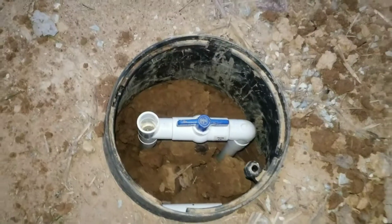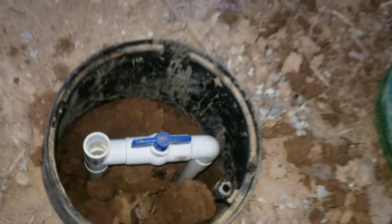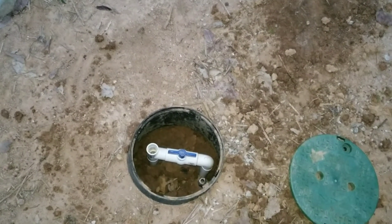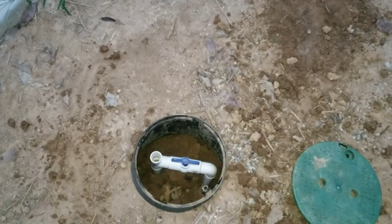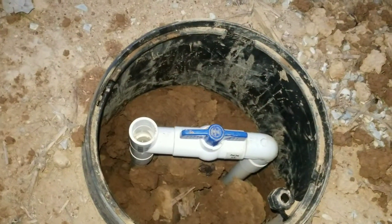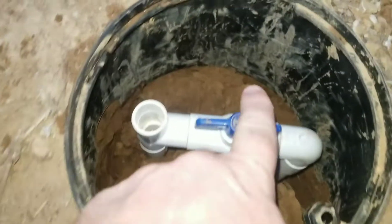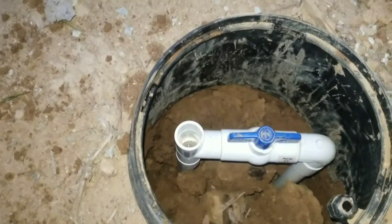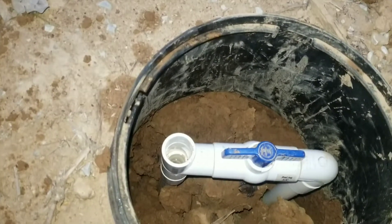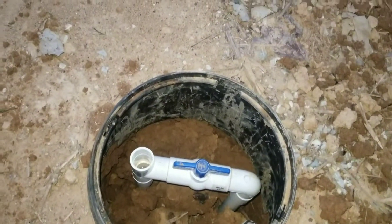I glued all the top pieces together. One of the things I did — you'll see a coupling down there on both sides — that'll bring my water level up another inch before it naturally flows in. I think this will be a much better design. I always encourage you to put a cutoff valve so that in the short term, if you want to raise your water level, you can, and you can open it back up when needed.